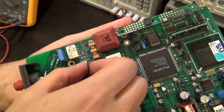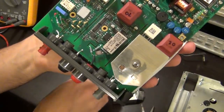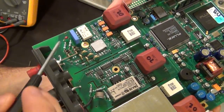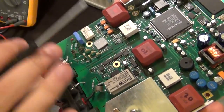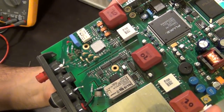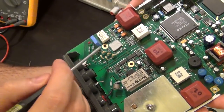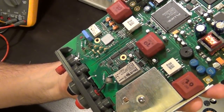So I'm going to put it right back where it is, and it is non-conductive electrically. I don't know what its dielectric constant is, so I have to look it up. But the reason I mention that is because sometimes if this stuff seeps onto traces that are intended to be very high frequency, they have taken the dielectric constant of everything around it into consideration. So if your thermal paste seeps onto the traces, you can change the dielectric constant in their calculation. Maybe they have accounted for air to be on top of the board, but then your thermal compound changes that, so the characteristic impedance of the line changes. And if the characteristic impedance of the line changes, then the delay changes, the bandwidth changes, the loss changes, and you're going to run into problems in high frequency design.